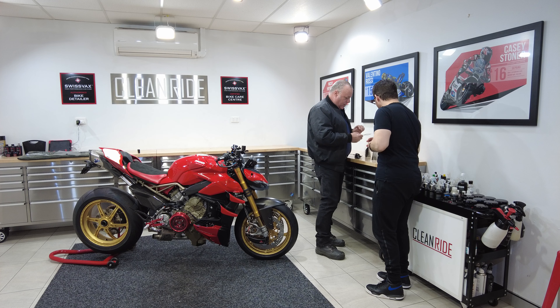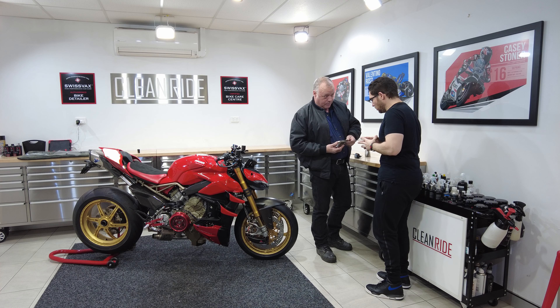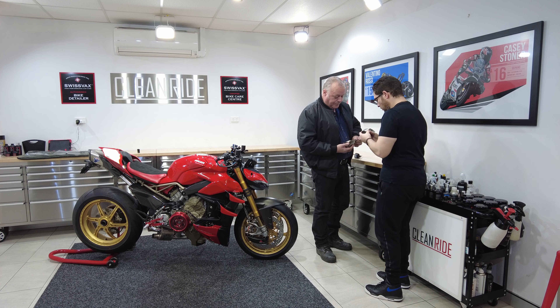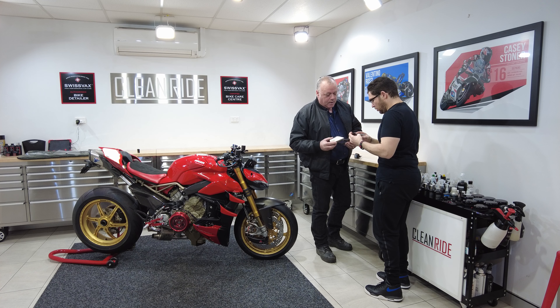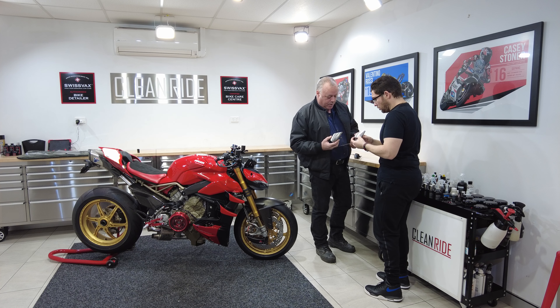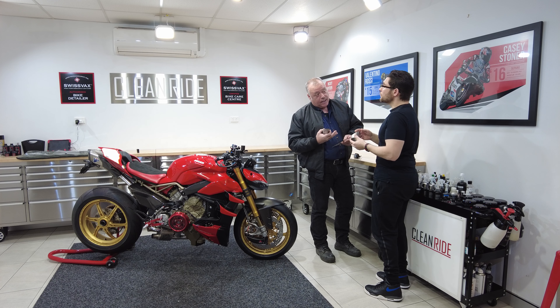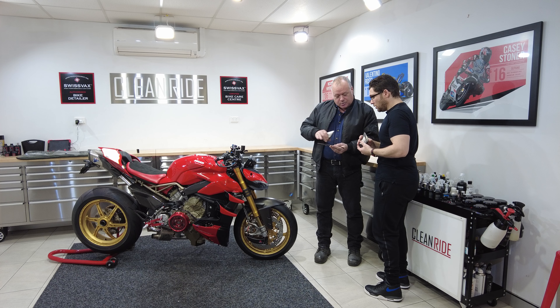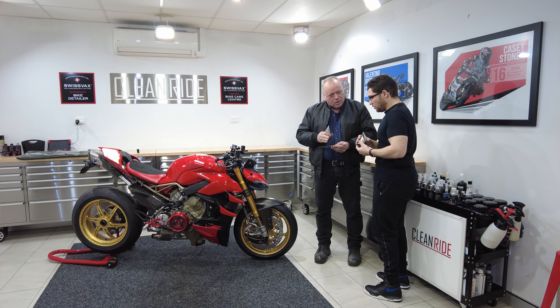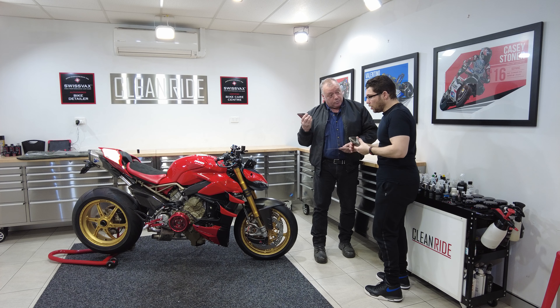What Jeff has done, as they discussed previously, was to remove the original tips from the framework that came with the other component. They very carefully cut the welds from the back — you wouldn't even know it was welded on. Because this stainless has been made to appear like titanium — bead-blasted with a satin finish and then slight temperature added to give it colour — Jeff did a test piece that morning and was able to duplicate the finish almost identically. They should be able to achieve that same finish on the tips and retain what's original to the Termignoni system on the bike.